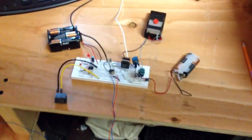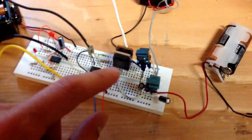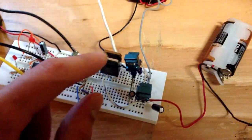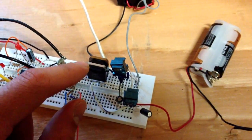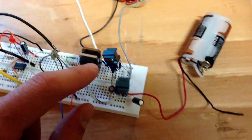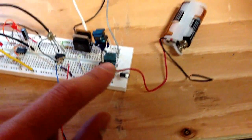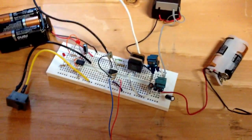Here's the schematic, and here's it built. Ignore these right here, but here's our 555 timer generating an AC signal. These are the two transistors which act as a push-pull amplifier. And here are two small transformers with capacitors, charged by their own AAs, to increase the voltage.